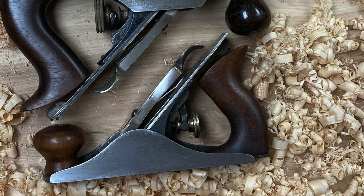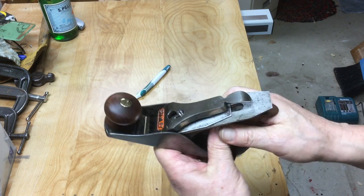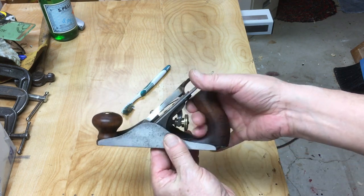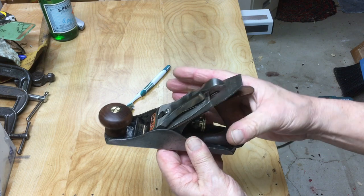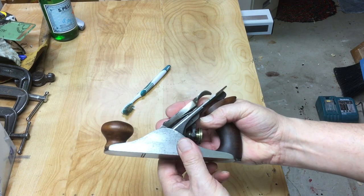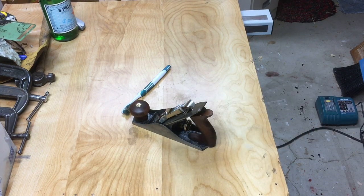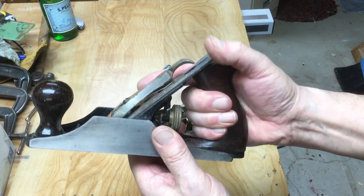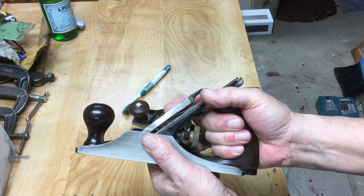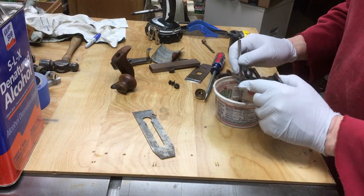The number two is a small plane. As I'm handling it, it's so small it's really hard to grip the tote at all with your full hand — you maybe can get two or three fingers through there. What I end up doing when I use it is hold it more like I would a block plane, not so much a typical hand plane. The tote is so small and so close to the adjusting nut. Even a number three, you've only got room for maybe three fingers. So the number two is just a tiny plane, again used more like a block plane.